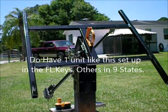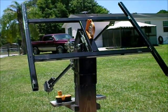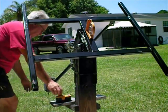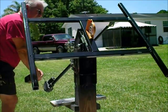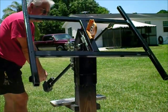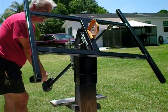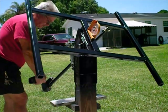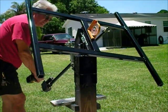This will hold up to six 300-watt panels. I think I'm going to buy six 280-watt panels. I'm just going to run this through with a Ryobi 18-volt battery just to show you. Now, if this was heading to the south right now, it would be tipping to the east. Right now it's looking at the east, so it's tipping to the north — it's just the way it's sitting here. I always want to move it south, and of course if you reverse the wires it goes the other way.